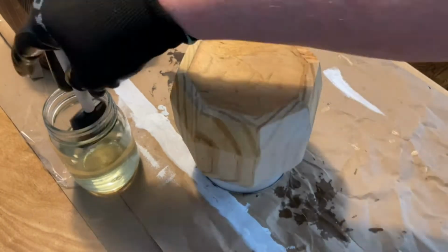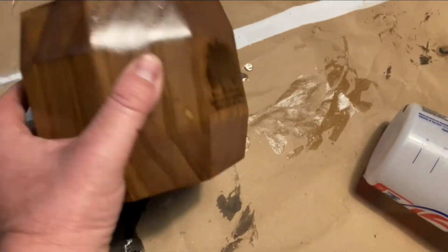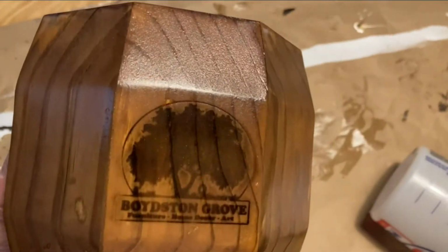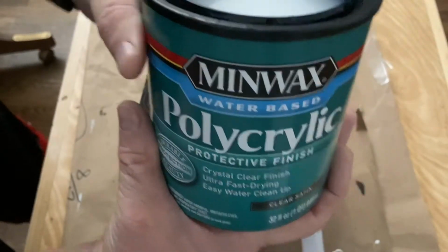I think it's because of the wood I used. I used a soft pine, and it's just so light to begin with, it'd be really hard to get it really dark. I think if I try this technique again, I'll use a wood that has a much darker tone in the beginning. To finish them off, I put a couple coats of polyurethane on them, sanding between each coat.